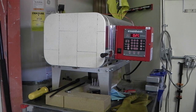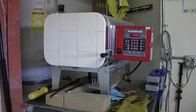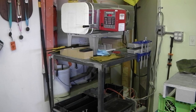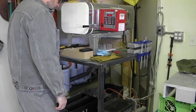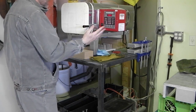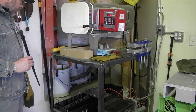Alright, we've reached 1,500 degrees. Now I'm going to start my timer - 15 minutes and then I'll quench the first blade. I've already plugged in my oils. The oil is up to temperature - anywhere from 125, no more than 150. Right now it's about 130.